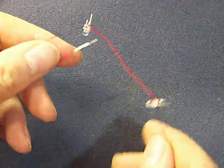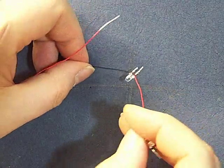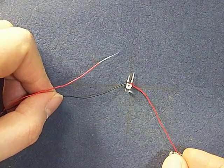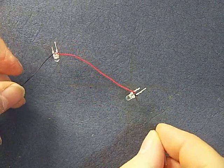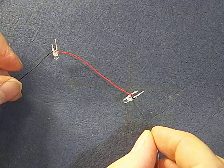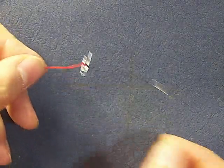Here I've got a string of LEDs that I've already started. I've got some red and black wire that comes in the Madman kit, and I've unwound one end, stripped the ends, and hooked up some LEDs to it. This LED is already hooked up — this is the last LED in the string. That's why the black wire from the controller card is on the short lead and a red wire to another LED is on the long lead. For an LED in the middle of the string it doesn't matter which color wires are on which leads, as long as the wire going from the negative lead of one LED to the positive lead of another is connected together — short lead to long lead.